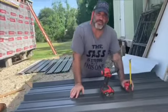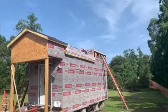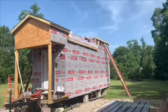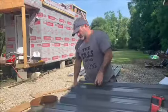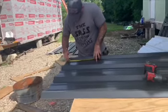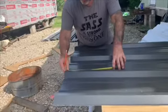Alright, so we've been putting the tin up. I got four pieces — already put up. You can see here I got two pieces, and on the other side I got two pieces. I'm going to trim it in of course. I have a corner cap that goes on the gable side right here. This is the tin — it's not easy to cut. I got socks with my sandals because the sparks are flying all over the place, keeps hitting my feet. So right now I'm pre-drilling holes so we won't have so much trouble up there when it's time to do that.